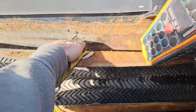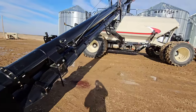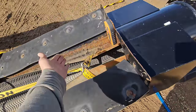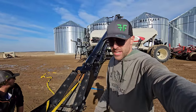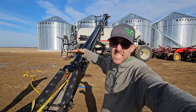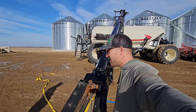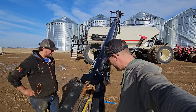So the problem is this belt — we pulled it off, it's stuck to the bottom of this steel. You can tell there's definitely some corrosion. You gotta remember this cart is not a brand new cart — it's a 2019 cart, it's seen a lot of fertilizer. Even though you wash it, there's going to be corrosion. Mike suggested putting oil up there to lube it, but just imagine what your drive roller would do with lubed oil — it would cease to move. That's actually the last thing you want to do. It might also tear your belt.